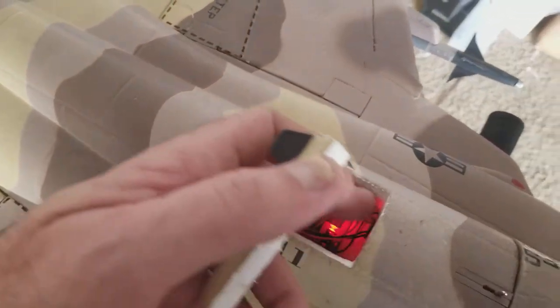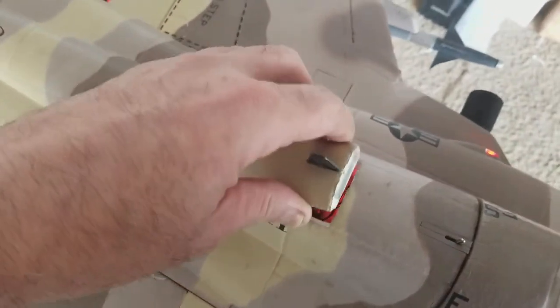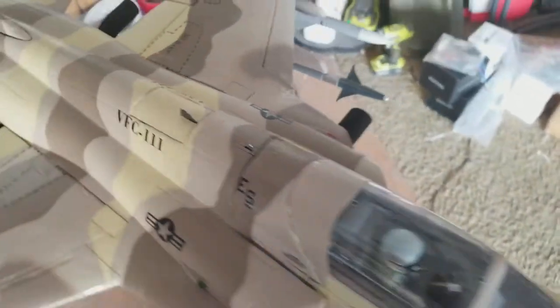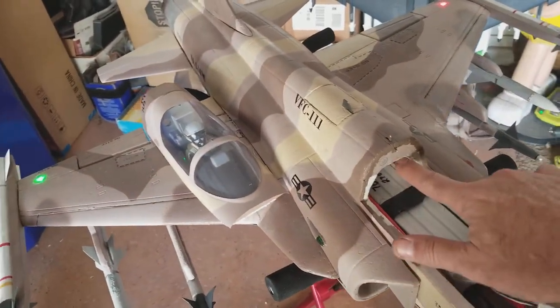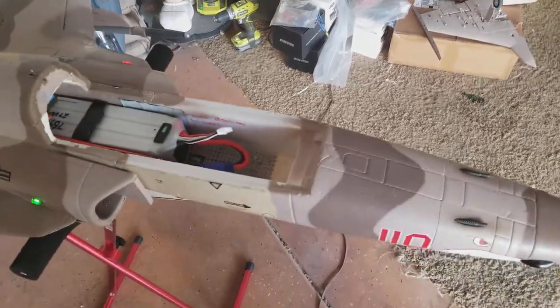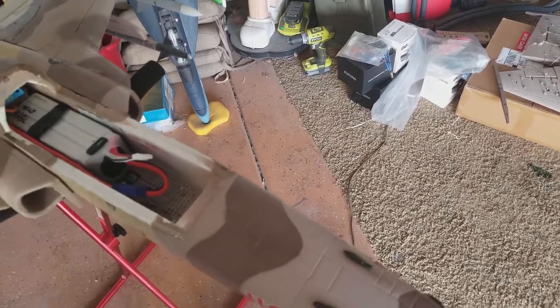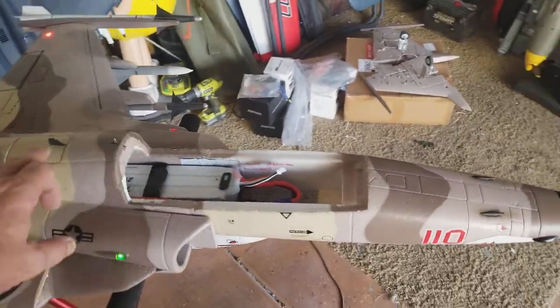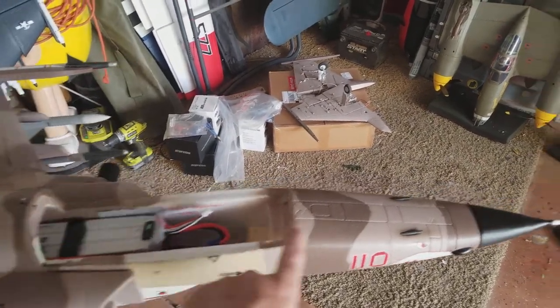Lemon 10-channel — there's actually a Freewing version 3 controller down in the bottom. I just moved my satellite earlier this morning because I didn't like its position. The battery was blocking it — it was actually mounted right there, but there was too much in the way. So now it is mounted up in the nose area where there's very little electronics and it's just foam. This is actually the one that picks up the stronger antenna, so I moved the satellite up here.